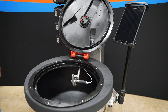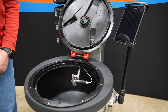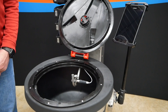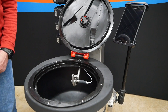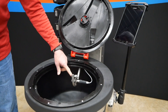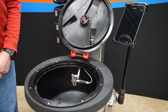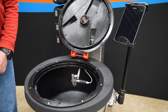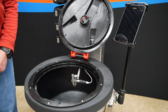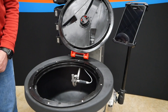Inside our inductor cone, you can see our jug rinse nozzle, which is used to drain jugs when air is connected and also to rinse jugs. Some operators will break the foil on full jugs right over that nozzle. When you put a jug on here, it triggers a lever which triggers the sensor — that tells the computer you want to rinse the jug. It will turn on the air, drain the jug, capture the weight when empty, and then turn on the rinse water.